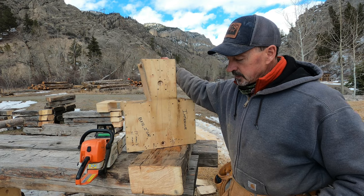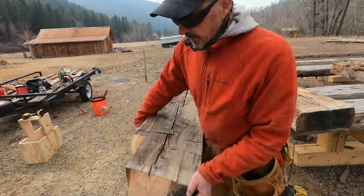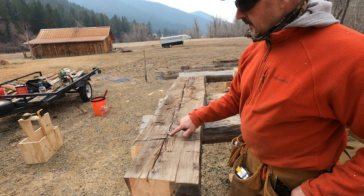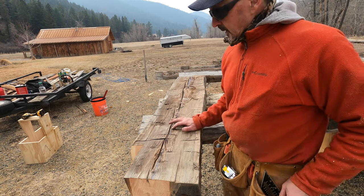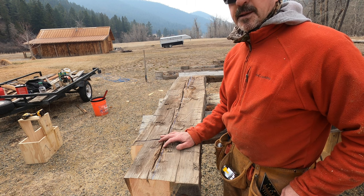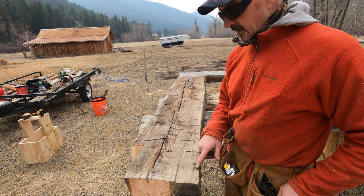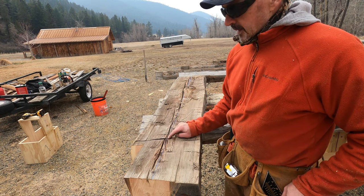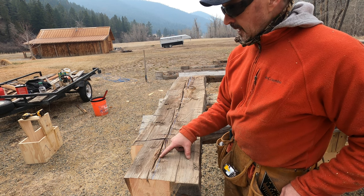Let's go ahead and put our center line down this log here. Earlier, the first step before you mount the jig is to put the chalk line down the center of the log. And we'll do that on every log, on every course. And as you stack the logs, that chalk line is always going to be level. Even if the edges vary, that line will be level. And so the floor is, of course, going to be parallel with that line.